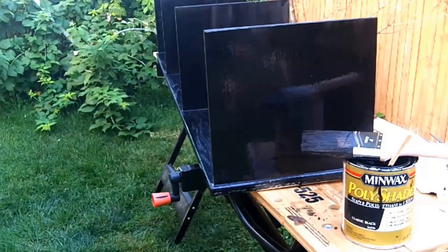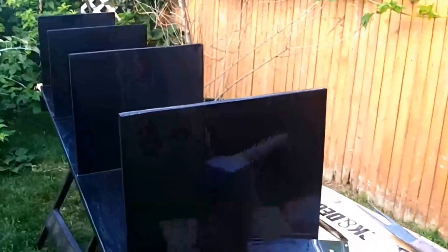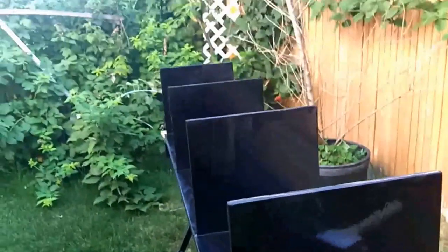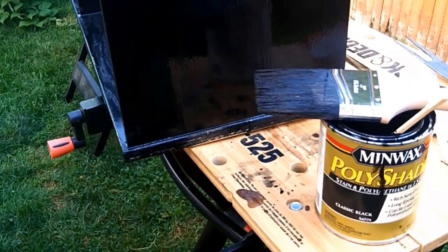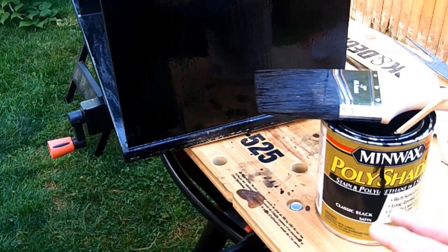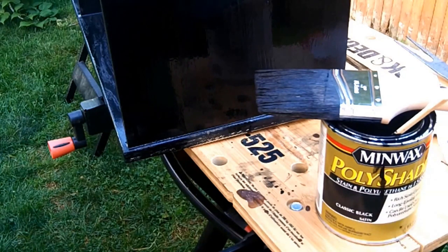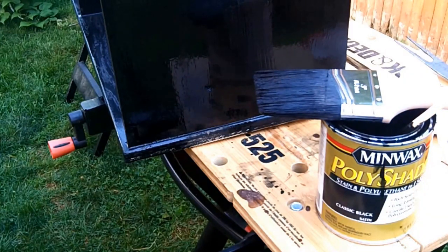I started painting the hutch on my music desk. The paint I'm using is Minwax Polyshades Polyurethane. The thing about this polyurethane — or any polyurethane — is you can never shake it. You don't want to shake it because you'll get bubbles in the whole thing. So what I'm doing is painting with a paintbrush, but I got a chopstick and stirred it up carefully so as not to introduce bubbles and air into the mix.